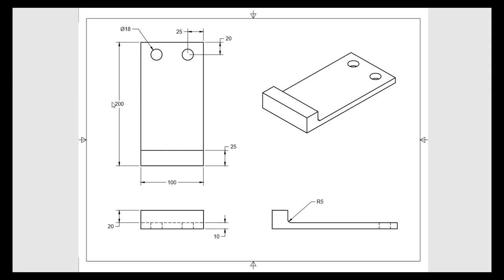In front of us we have a PDF of a drawing of the geometry we're going to draw together. I throw this up on the screen just so you have a sense of where we're headed. This PDF is also available on the course site — you can download it and look at the dimensions while following along. Here is an isometric view: a relatively simple base plate with another rectangle extruded on top of it. We're then going to cut out two circles and add a fillet, which is easier to see in the side view.